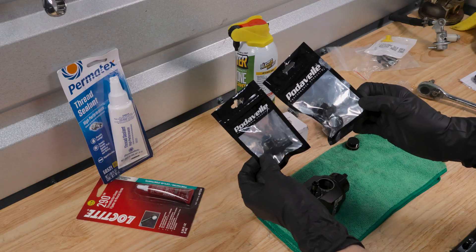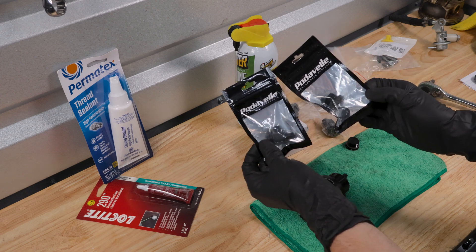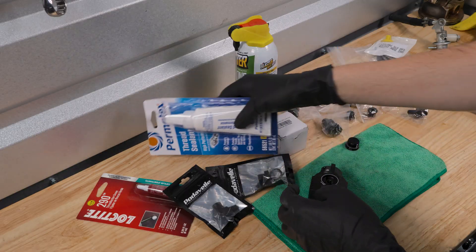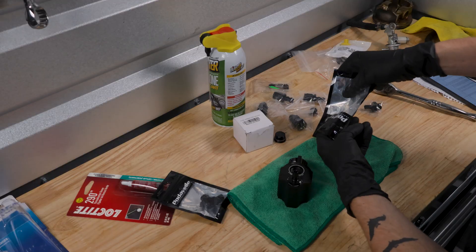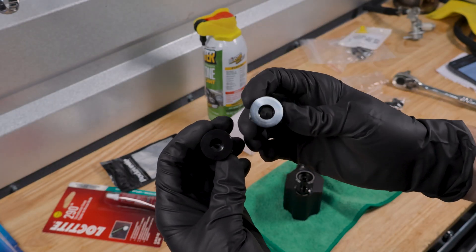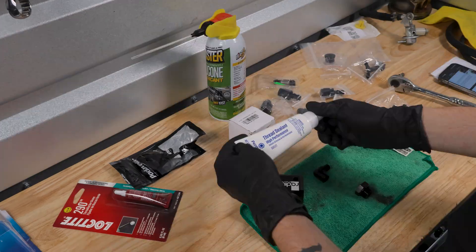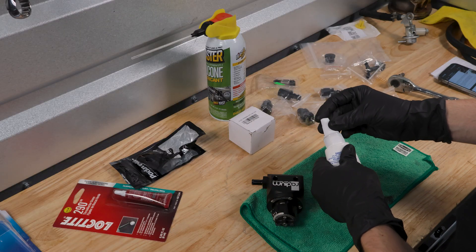Radium does sell these fittings on their website, but honestly you're better off just buying them on Amazon — they're cheaper. These cost me $24 and arrived in one day. Also worth mentioning, we're going to have to use some Permatex 56521 thread sealant. In case you guys want to buy the same fittings, I'll link them down below in the description. There's fitting one and fitting two — one is just circular and one's hexagonal, and this one has threads for an adapter. We're going to lube up the O-ring. The instructions say to use thread sealant everywhere on the MPT threads, so that's what I'm going to do.